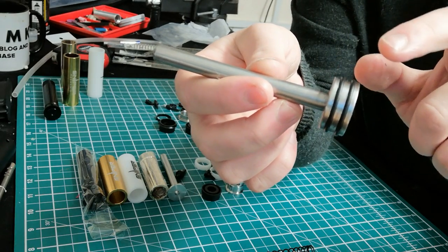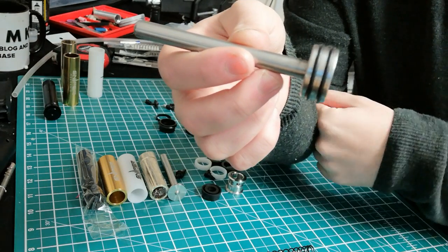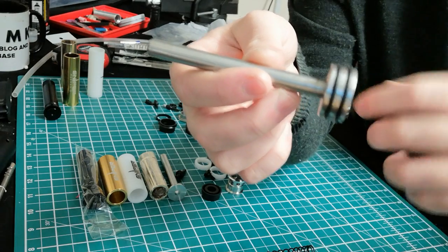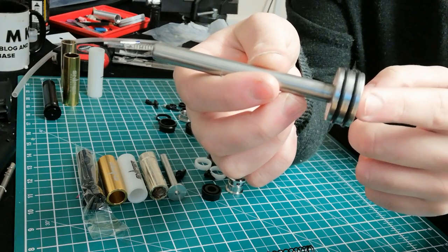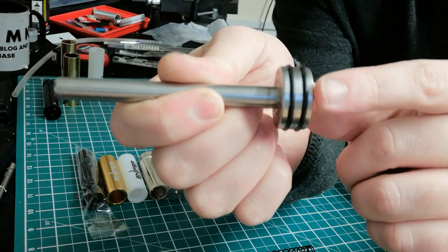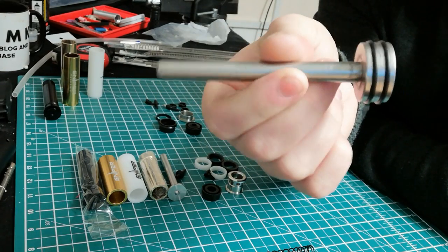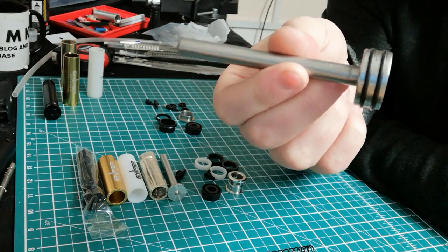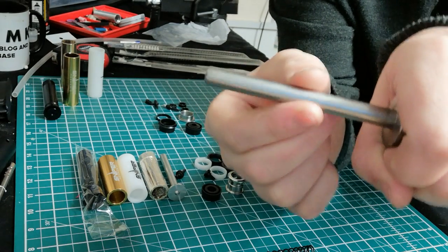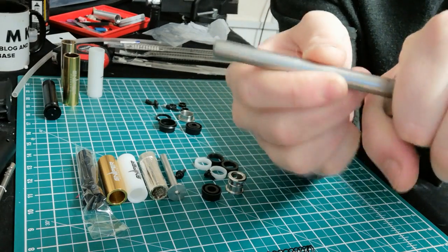When you get it, you'll have some O-rings — there are four O-rings. Two of them are half a mil smaller than the others. The reason for that is on the latest batch of SRS rifles, the 2018 model, they tightened the tolerances on the butt pad, so the original O-rings were a bit too tight. You'll get two sets of O-rings: one to fit anything up to the 2018 model, and another set for the 2018 model onwards. They slip over and sit into the two grooves channeled out here. The benefit is it keeps the spring straight and stops this from flapping about inside the butt pad, because that is one of the main areas of sound on the SRS. Most aftermarket spring guides wiggle in the butt pad hole, allowing the spring to move. With this design, the mass and flush fit means it just doesn't move.